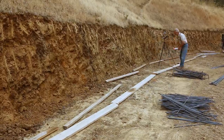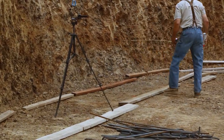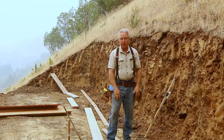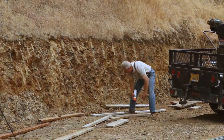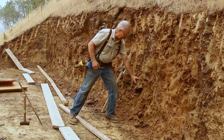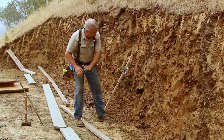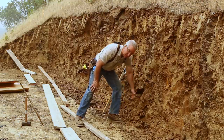He has calculated that I need a footing four feet wide, 12 inches thick, two mats of rebar. You're going to see me set the edge form — the face form — for the outside edge of this footing. The back side is going to be formed by the bank. I don't have to set a form back there. If I did, I'd have to strip the form and I'd have a void that's not 100% in contact with the bank. So I'm just going to let the bank restrain the concrete on the uphill side.